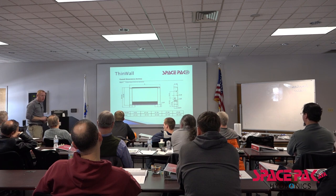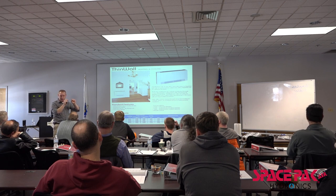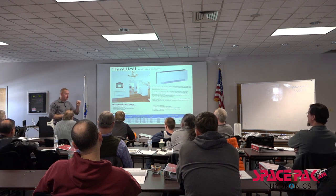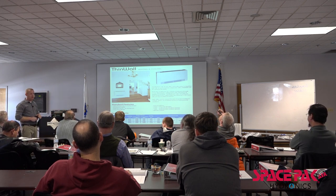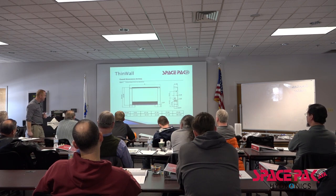That has air filtration, but does the high wall have it? Yeah, the same kind of little filters that you pull out on a ductless split. The HEPA? Yeah. That little tiny HEPA filter? Yeah, we don't have the HEPA filter thing in there, but you lift them up to the screen. I'll show them when we get outside. They're by no means super fancy, but I don't believe anybody's are at the moment. There's no MERV filters going in a ductless split anywhere.